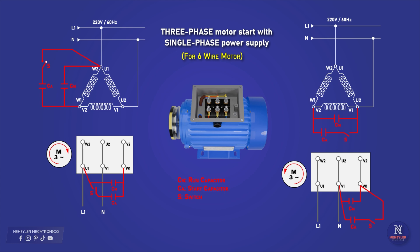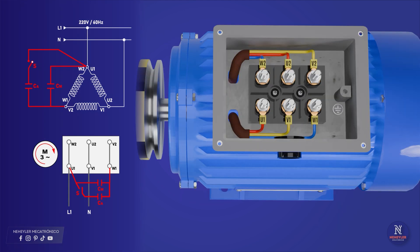The connection diagrams are shown here. The top part shows the configuration of the coils in a delta, while the bottom part shows the terminal diagram of the motor and how it should be connected. In the motor terminal box, metal strips must be used to join terminals U1 and W2, also to join V1 and U2, and finally W1 and V2. If you only have the 6 cable ends, you must make those 3 connections as indicated in the diagrams.